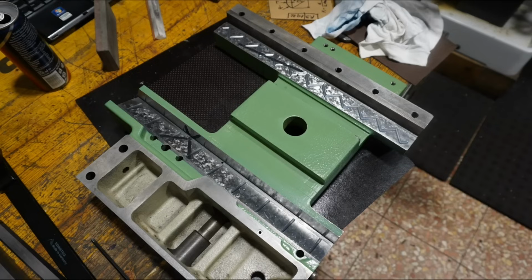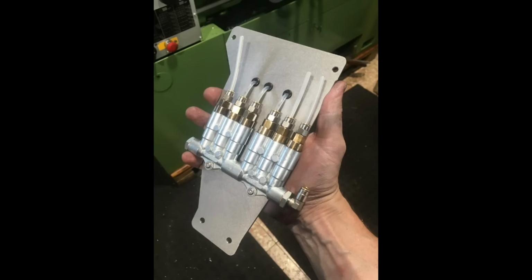And I couldn't help it, I had to re-scrape the slide surfaces because I couldn't look at them anymore. And as a tool for bluing, I used the bed slide on the very right end where the tailstock usually rests. You can see how the epoxy filled old lubrication pockets are now nicely scraped with all the other surfaces. That was a nice meditative work for a change.